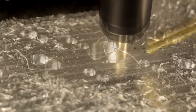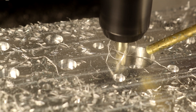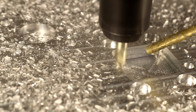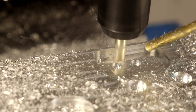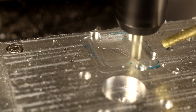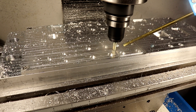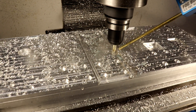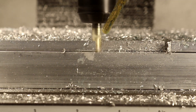This will become one of the two NEMA 17 motor support plates. The camera attaches to this part, and this hole is where the ethernet and power cables go through. Now that all the holes have been made, the parts are contoured and they're held together to the remaining stock by tabs.